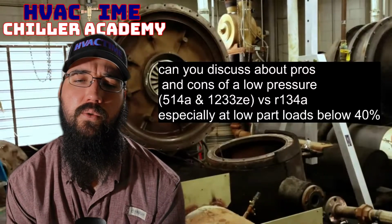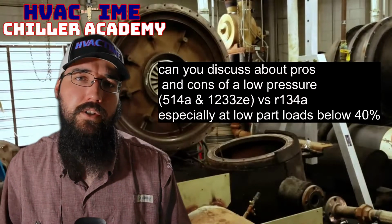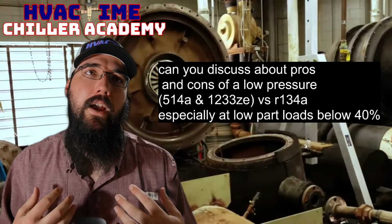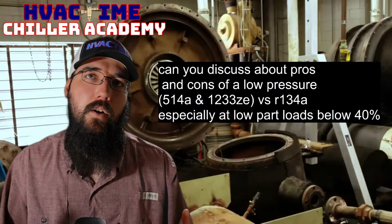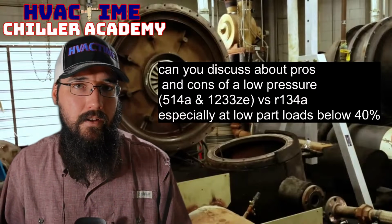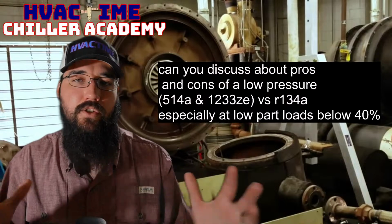Now, getting into the part load, below 40%. Again, they're low pressure refrigerants. We've dealt with low pressure for a lot of years. Now, I say that, but let me back up for a second. I came up with a lot of fairly old equipment, so I have to take that into account. Like I worked on the YT, which was the low pressure York centrifugal before the YK. So I have a mindset of it's just low pressure, right?